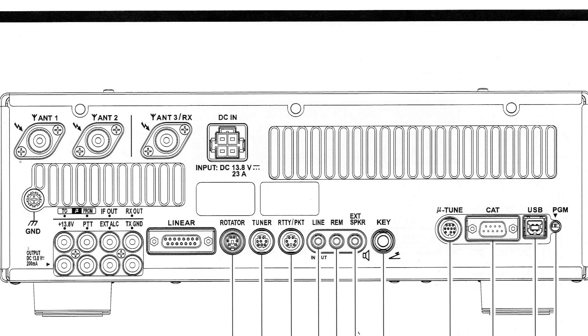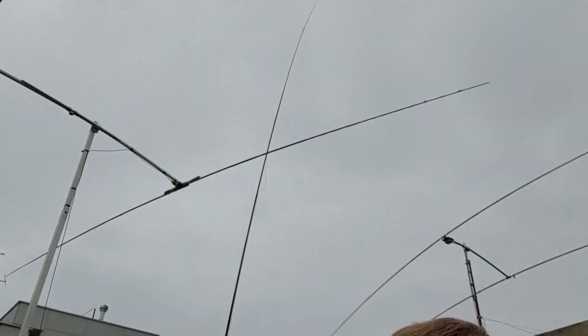What I really love about this FTDX3000 and this receive antenna port is that it allows me to quiet down most of that noise by attaching a non-resonant antenna to that port. I really want to stress: if you're in a noisy city environment and you're fighting noise, one of the best things you can do is get a radio with a receive antenna port, set that up, and use a non-resonant antenna. On 40 meters I run a 20-meter antenna — a 20-meter two-element Yagi — as my receive antenna, and I transmit on the big 40-meter vertical antenna.